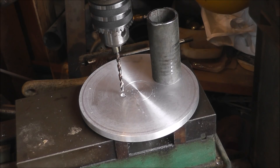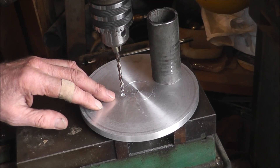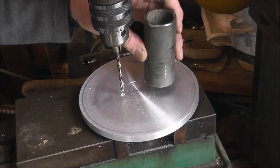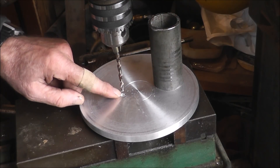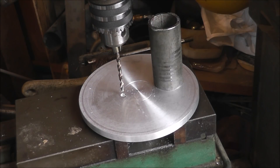Here's a little trick that I've used over the years. I want to put a shaft through here, but before I do that I want to have a keyway. What I've marked out is a little circle of the diameter of the shaft I want to use, and right on the edge of that I'm going to drill a hole all the way through before I make the main hole. That way I have a little slot for a keyway — you can clean that up with a file. It just saves having to buy a broach to make a keyway. It's a super simple way to make a keyway any time you need to fit a slot in a shaft.